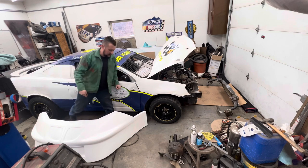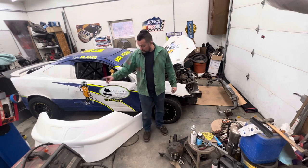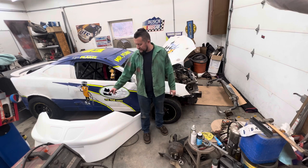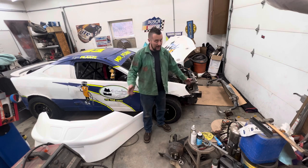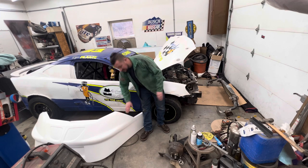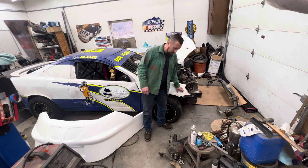This nose is what a lot of guys use for the RSX — it's kind of the same shape, it's the closest you're going to get because they don't make an RSX nose. A friend of ours runs this nose on his RSX, so that's what Ryan bought. Looking at pictures of how our buddy Chris mounted his, it looks like he overlapped the fender with the nose and riveted it right to the outside of the fender. Ryan's okay with that, so that's what we're doing. We'll trim this lip here so the front piece is more flexible and then form it to the fender.